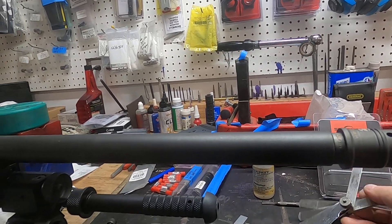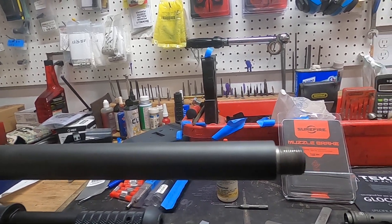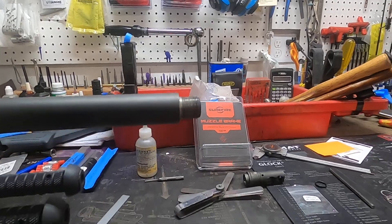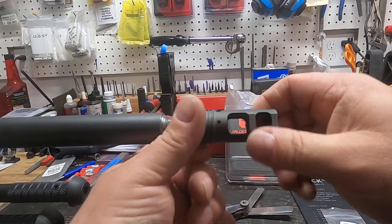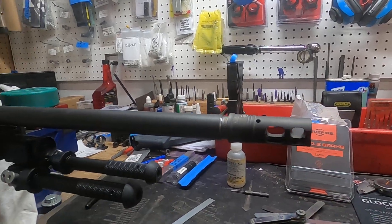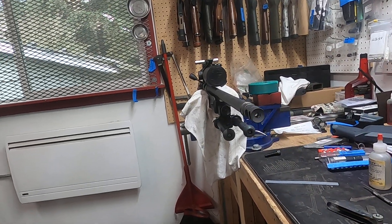Using the feeler gauges you can cut some of the trial and error. You can then use calipers to get a shim stack together, put the stack on there, and it'll be really close. You don't want to be perfectly set because when you tighten it you still want some room for it to move.